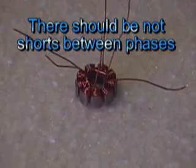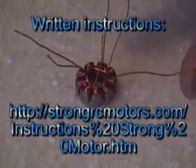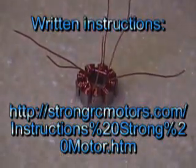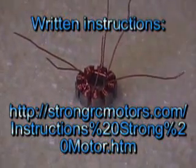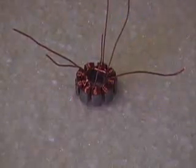If you're going to terminate a motor in Y configuration, you either connect all of the starts or all of the ends together. It doesn't really matter. I usually connect the ends just because that last phase ends up sometimes being a little bit loose and it's easy just to hold it all together that way.